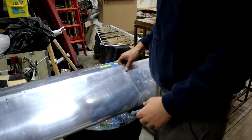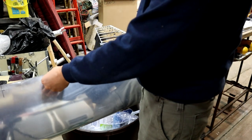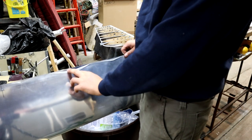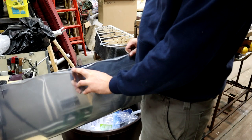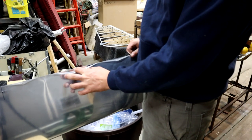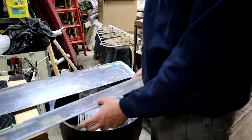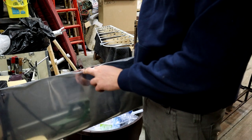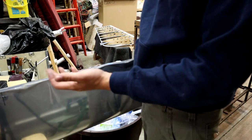These Flaperons are so cumbersome and reflective, but the trailing edge of this Flaperon needed rivets to hold it together even though it's already glued — the rivets are extra assurance. This is the actual popped head side, the rounded side that's not flush, and then the flush side is on the other side. It's countersunk and perfectly flat with the trailing edge, so they look a lot nicer than a pop rivet. You'd have a rivet nub on the backside if you did it the normal way.